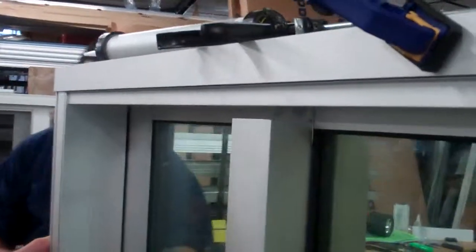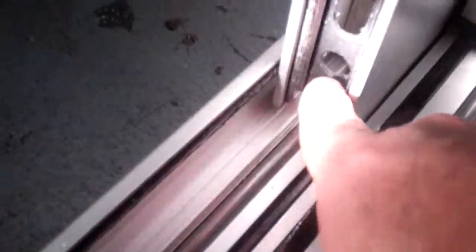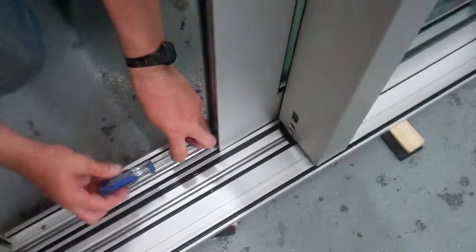We can now close the doors. The next thing is to adjust the sliding panels so they operate properly. To do that, take a number two Phillips bit screwdriver — the second hole from the bottom is the hole with the roller adjustment screw for the rollers. There's one on the latch stile and one on every interlocker. Adjust the wheels so the panel operates smoothly, and you'll see the panel glides very nicely.